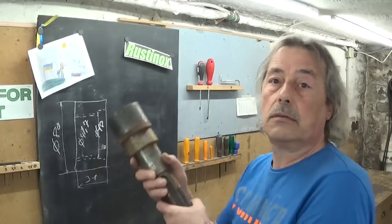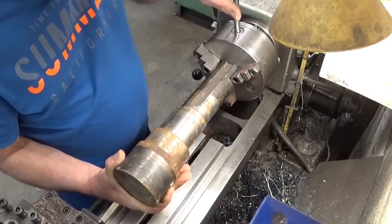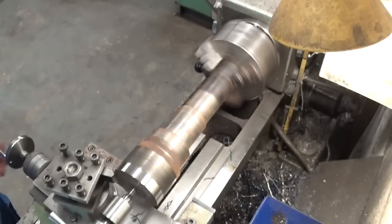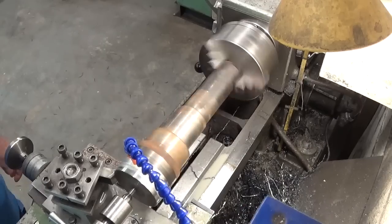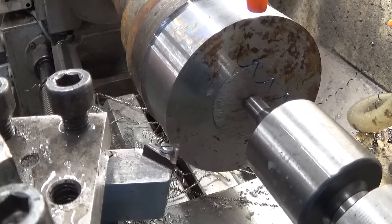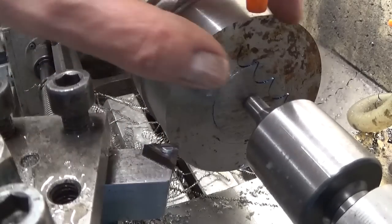I think I found exactly what I need, and if you think it's a little bit overkill, you're right - I think so too. It's hard stuff and it leaves a very nice finish. Let's use some coolant. I'm testing out these new-to-me inserts - I forgot the name of course - and they seem to work fine. They make cute little spring chips and the finish is not bad. It could be better but I think it is not bad.